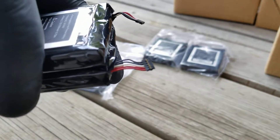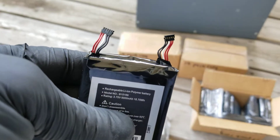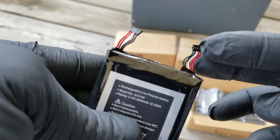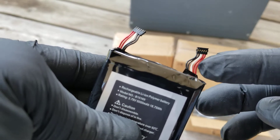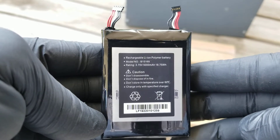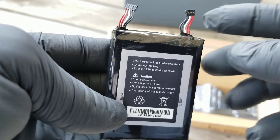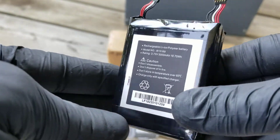So you just have to snip this wire right here. If you cut this out — hope you can catch this on the camera — cut the reds one at a time. Don't cut them all together; you don't want to short the battery. If you want to cut all positives together, I think it's fine. The white wire we're not going to use — that's supposed to be the battery temperature sensor. So cut the positive and cut the negatives. Connect them. But this is going to be an interesting project — it's going to take a while, it's going to consume time.